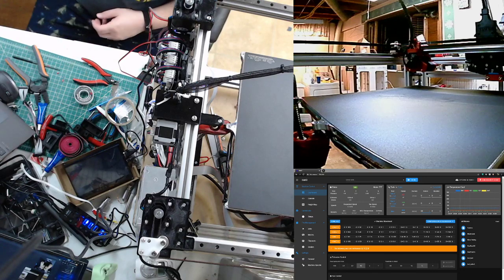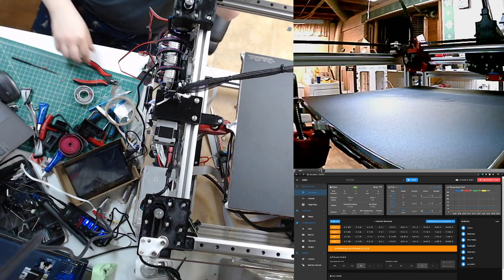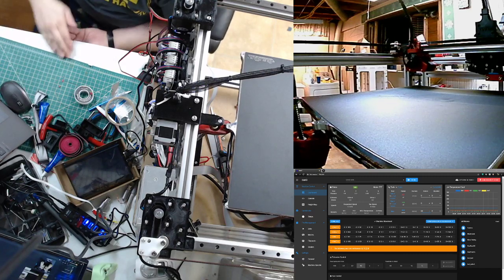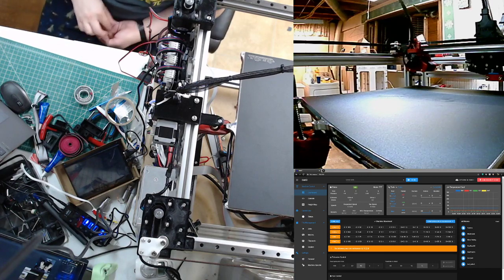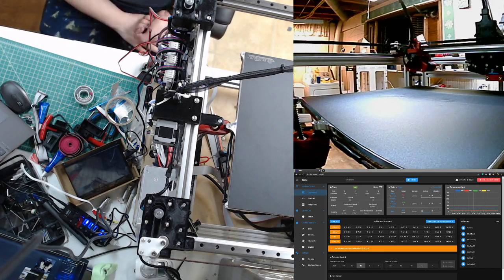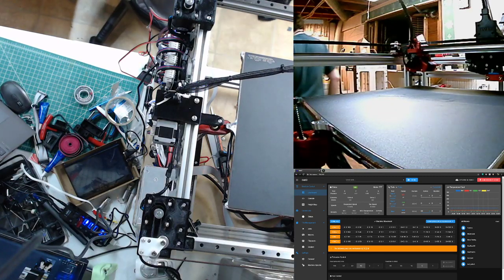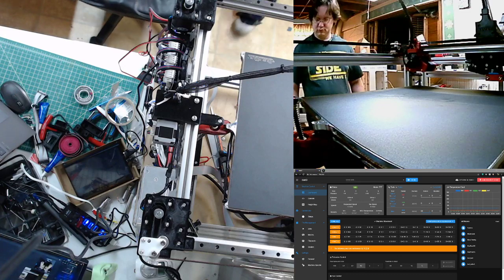But the amount of clearance on those, I'm literally dropping the bolts in, giving them a bake, and lining up, or dropping the screws in. Okay, then I'll take a look and see how much bigger you made them, because I think I was set for the close size, which is 5.3, and then I spaced it out to normal, which is 5.5, I think.